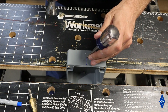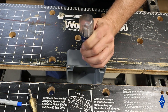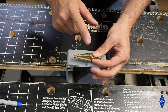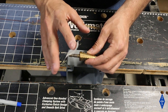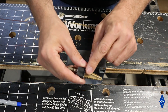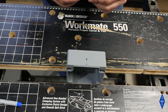I'll use a center punch on the center line of the hole to make a little divot so that when I drill the hole the drill bit doesn't wander too much. Now I'm going to drill a 1/8 inch pilot hole on the center line, and then I'll use my step bit to open the hole up to 5/8 inches. To make sure I don't drill too deep, I'm going to wrap a piece of tape around the drill bit so that the 5/8 step is exposed but any of the bigger ones are covered — that way I'll know when to stop.